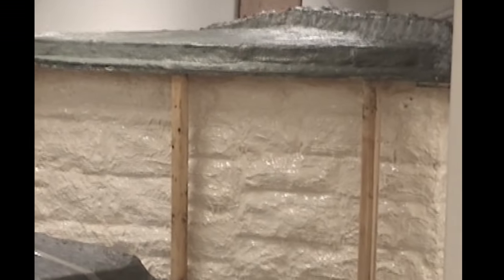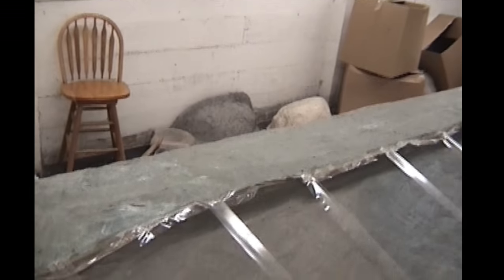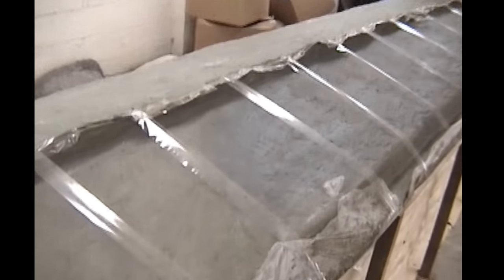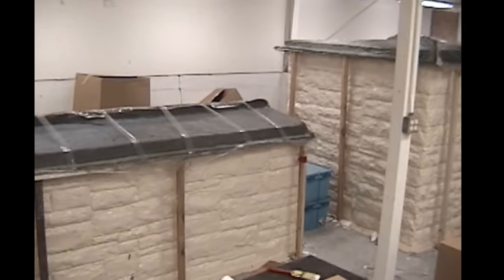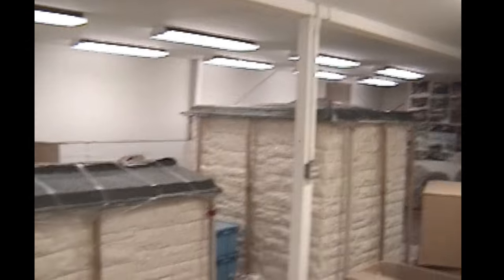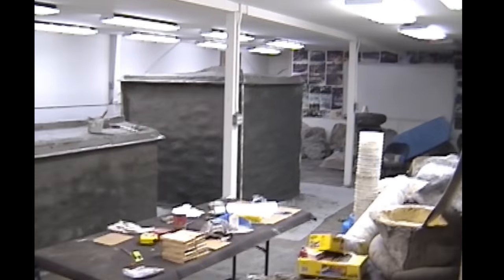Well, we've cast both halves here now. On the tops of both of the boxes, they've got their hard molds left and right, both sides. You can see that here now. And we'll bolt that. The flange gets drilled and bolted before we actually remove it. Both of these will. Next, after that's dry, the next day, I think, or I'm not sure if this was over a 2-day period or the same one day, they'll remove all these sticks and the forms that hold up that top. Because not only is there a flange on top, but underneath this cap, where the panels go up the wall to hold the rubber, there's going to be... All these have 4 sides.